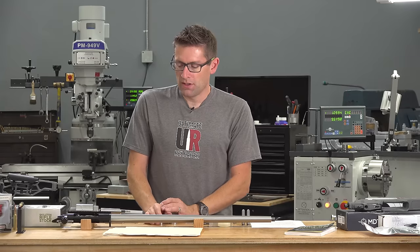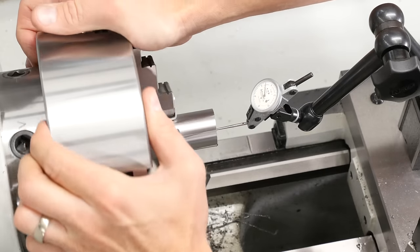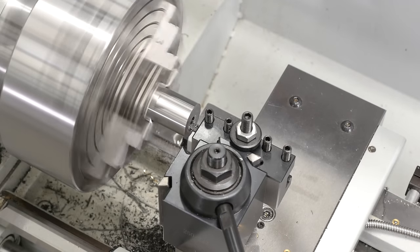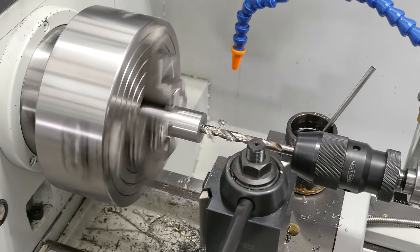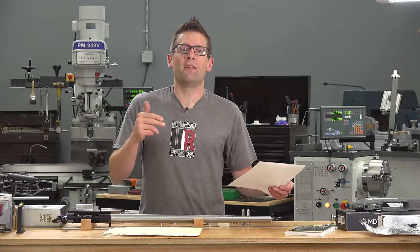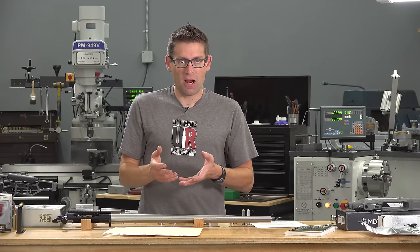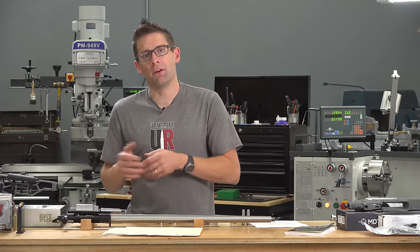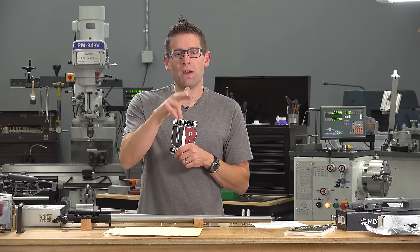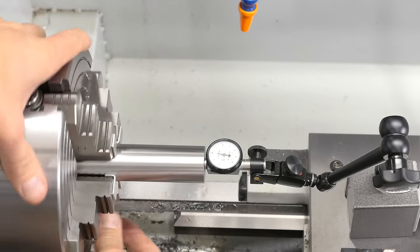I cut off three-quarters of an inch and then did an initial dial-in on the lathe, getting it dialed in directly reading off the lands and grooves. Then I faced the end of the barrel and did a pre-drill — a three-eighths inch drill bit followed by a 29/64-inch drill bit — drilled in 1.55 inches. One reason for the pre-drill is to remove the bulk of the material from the chamber area since I'm using a finish reamer only, not a rougher then a finisher. The other reason is so you can get your indicator nose much further into the breech end and direct-read with high sensitivity right around the throat area of the finished chamber, which is the most critical area because that's where the bullet is going to be aligned to the rifling.